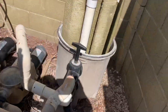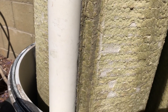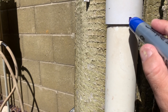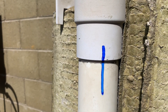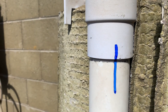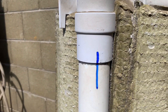One thing I like to do — as long as the filter is working properly and you're not trying to repair anything — you can take a marker and draw a line like this across the filter and the housing. Then when you put it back in, just make sure those lines line up, so you know that's the exact spot it was before you took it out. You don't have to do that, but it's something I do sometimes just so I know. Since it's working fine right now, as long as I put everything back in the same exact spot, everything should work fine.